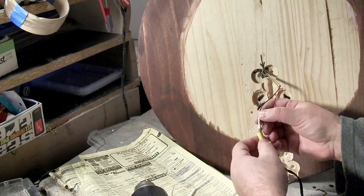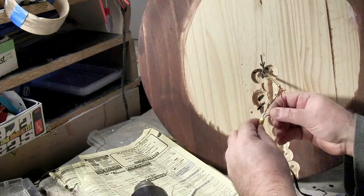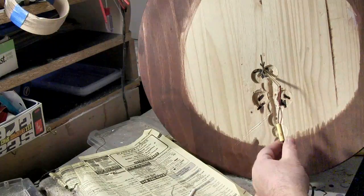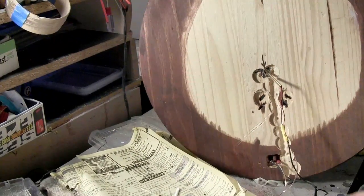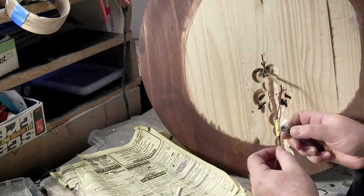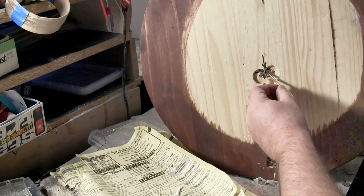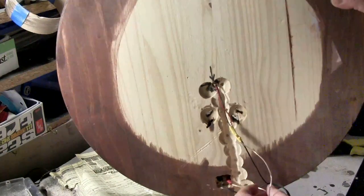The idea behind heat shrink is that you don't have to get it all tight down, you just gotta lock it on there and keep it in place. So if you got a lighter, that'll work too, but as you saw, this one's kind of weak here. I think lighters are a little dangerous because they're just as uncontrollable, I guess. Not dangerous as far as like lighting stuff on fire, but dangerous insofar as you could burn through the wire itself. The heat gun gets hot, don't get me wrong there. That's a few hundred degrees Fahrenheit or Celsius.